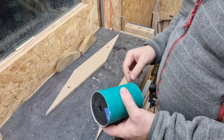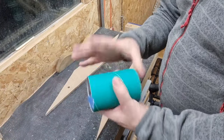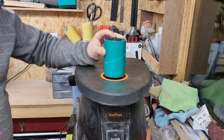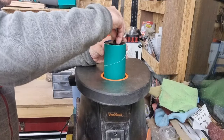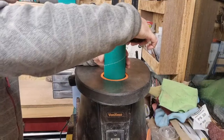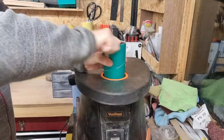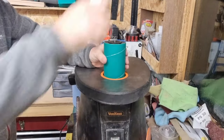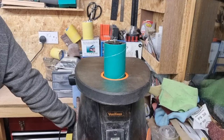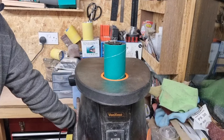You may need to do a little bit of trimming with a sharp blade if it's slightly too long, but now it's good to use. We just pop the drum on the spindle as normal and tighten the nut until there's just enough friction to hold the sleeve firm. And boom — there we have a cheap and effective replacement for all your favourite sanding sleeve sizes, and the happy-go-lucky guitar maker can make dust to their heart's content.